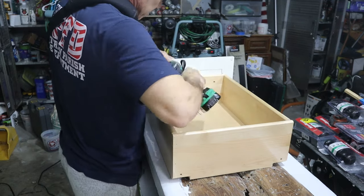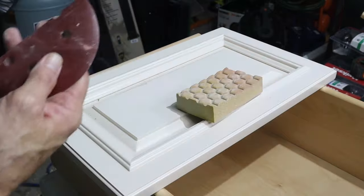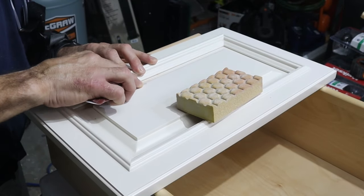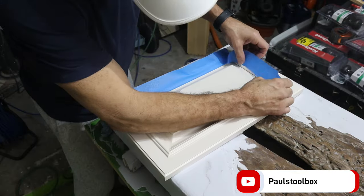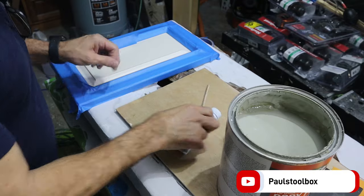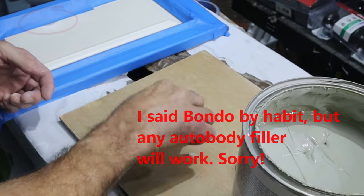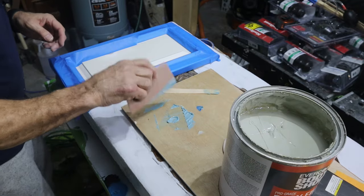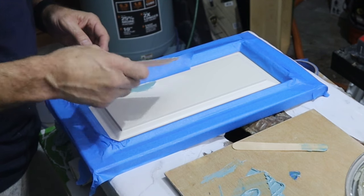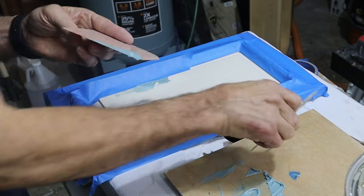The first thing I did was remove the drawer face from the drawer. I used a 220-grit sponge just to knock off the debris. Once I smoothed it out, I came back with 120 sandpaper and sanded the whole area so I could put Bondo on it. Since I only need to repair the center panel, I taped off all the other areas and put tape right below where I'm putting the Bondo so the body filler won't go into the grooves below. Then I come back over and fill the spot — you want to overfill it because it is going to sag.